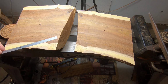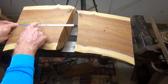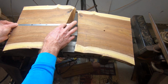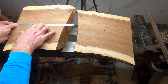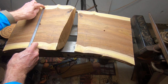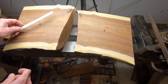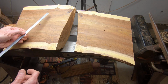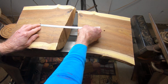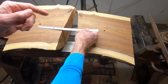So I wanted to go ahead and knock the corners off, and you can see that's about 5 point something, and this is about 10.5, so it's basically split at 5 1/4 or so. So 5 1/4 out is going to be about there. So I'm not going to knock it off exactly tight, but I'm going to knock off, since 5 1/2 is the max radius it can be, I'm going to do 6 1/2 radius to just knock the tips off, both of these.